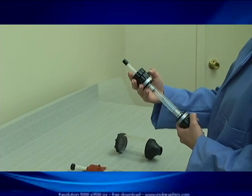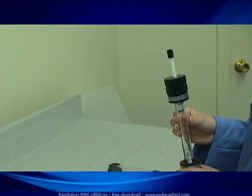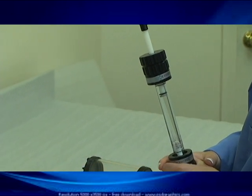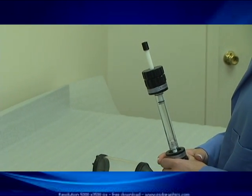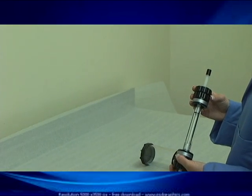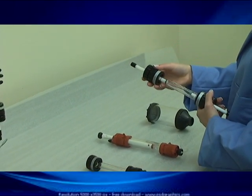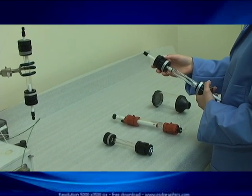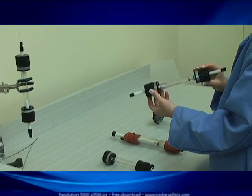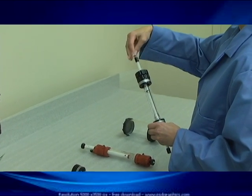The redrawing creates a thicker wall, giving the column a much more robust design and increasing its pressure tolerance. This one centimeter column has a pressure rating of up to eighty bar, or about one thousand psi, which is almost the limit of a stainless steel column of comparable size. This may enable the scientist to use a smaller diameter or higher performance resin, producing better chromatography results. Even if your pressure needs are not this high, the column still provides a much more robust design, making column breakage almost a non-issue. This precision also eliminates the need for an o-ring adjuster.